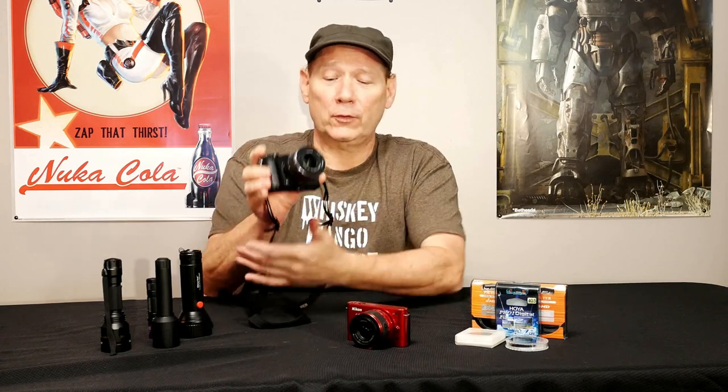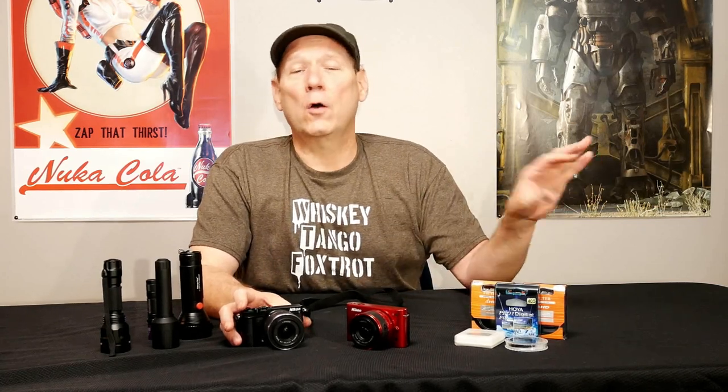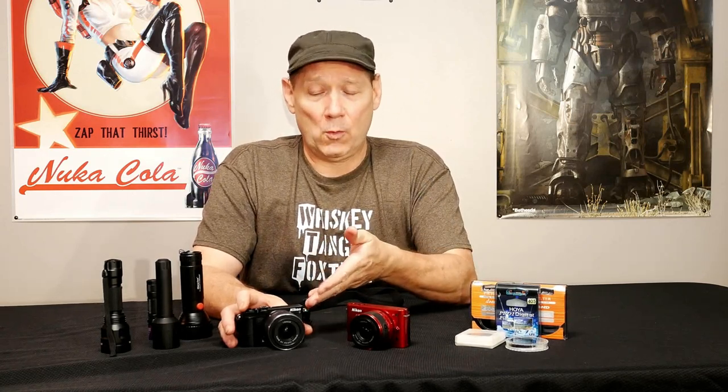And what that really entails is all your cameras have a built-in filter that basically blocks the sensor from being able to see into the ultraviolet range and into the IR range. Because we want our images to look like what we can see, not what the sensor is capable of. What you do with a full spectrum camera is you remove that piece of glass, this optical filter, and you replace it with a piece of glass with the same optical qualities, but no filtering on it, to allow this camera to basically take in all the frequencies of light it's capable of seeing. Okay, so that's a full spectrum.